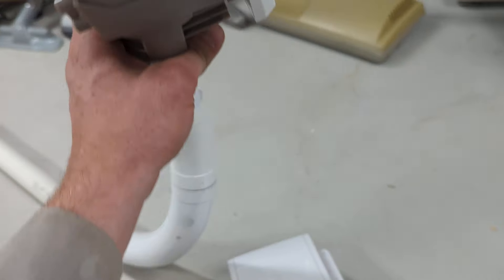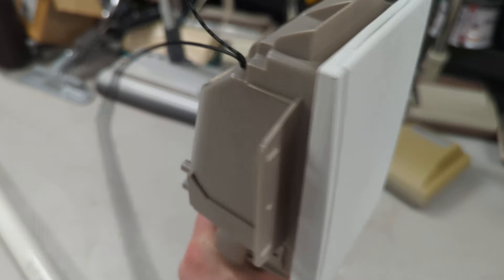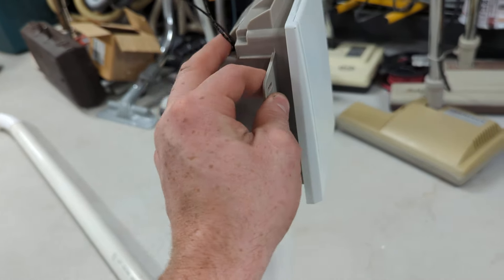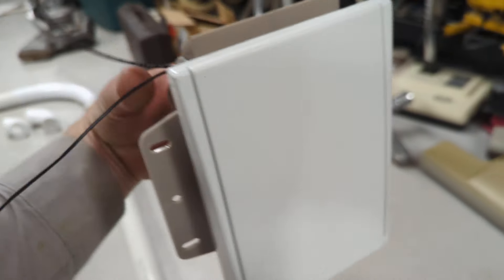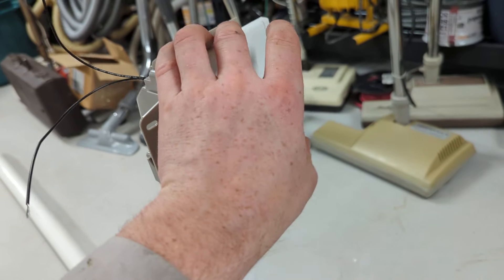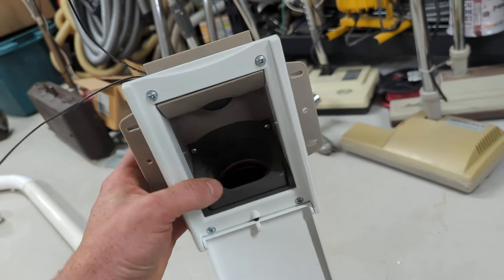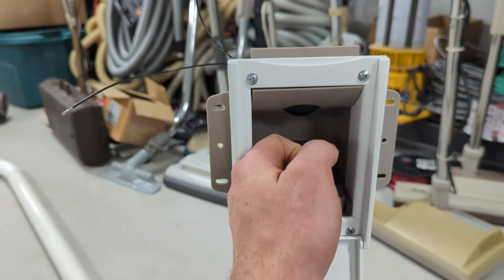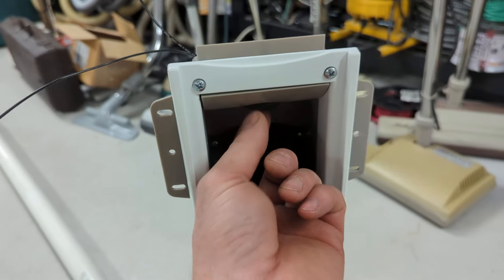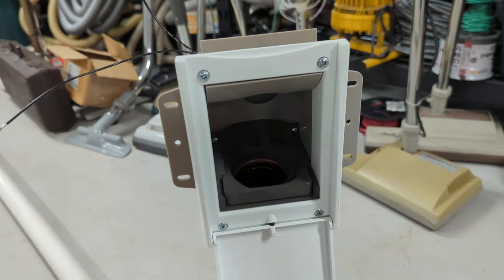Let's look now at Chameleon. The Chameleon is kind of opposite in a lot of ways. The basic concept is the same — you have the valve box with the guts, which you put in during rough-in, and you either screw one of these flanges onto a stud or break them off for retrofit. On the Chameleon, you do not need to seal the door — there's no gasket, and there doesn't even need to be a door. It's the hose end sitting between the O-ring and the rubber ball that seals the system off when the valve is not in use.